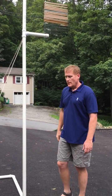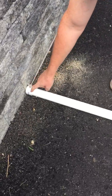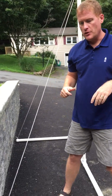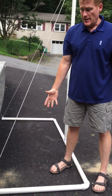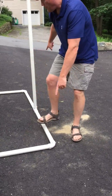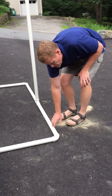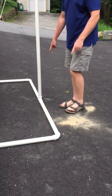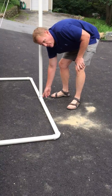First step: assemble the base. Take the two base sections, glue on your end caps — put glue on both the PVC and the cap, stick it in, and let it dry for a minute or two. Do the same for both. Then fill these up with sand to weigh the thing down and give it stability. Next, glue an elbow onto both of those, wait a minute or two, then attach a three-foot section to each one and let it dry. Fill these two up with sand as well.